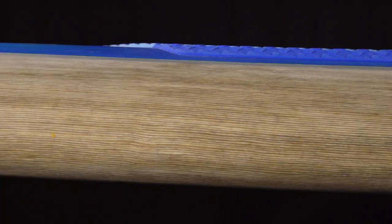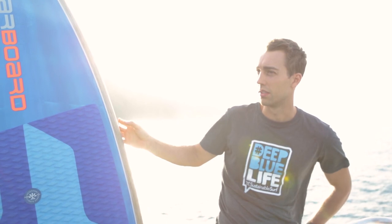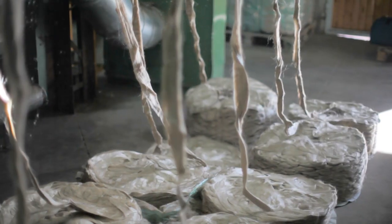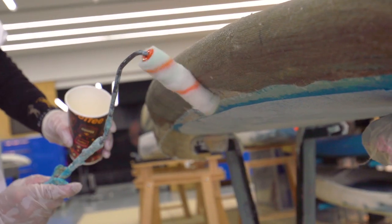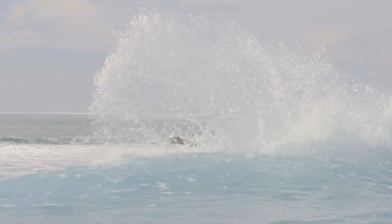The flax, for instance, we have a UD flax rail. So it's a really cool natural material that we get from Europe. And it's like 90% less energy used to produce this than glass fiber. So that's amazing. And it's way better for the guys working on it too, in the shop. Sure, you don't have those carbon itches. Yeah, it's easier. And the stiffness of this flax has performed better than some carbon fibers, which is insane.